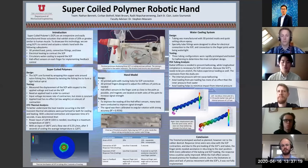For our goals, we wanted to streamline this model and add support for feedback control. For our design, we used flexible plastic — in our case, NinjaFlex. The hand was designed to be printed with the fingers hyperextended, so that when they were strung up, they would want to return to the natural hand position, with the SCPs contracting the fingers and the hand itself pulling back. In our first iteration, we printed the full hand and found that this took really long, and if the prints failed, we had to start over.